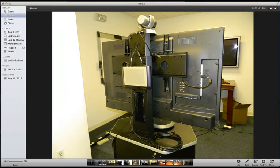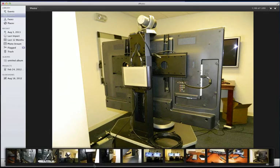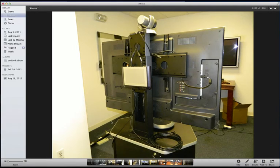Then obviously the Cat5 connection comes down from here, coils onto the rack, and sets your LifeSize phone out in front of you. And then you have a Cat5 connection that connects into the blue LAN connection on the codec. That simply runs down here and goes to the floor, connects to wherever your box may be, and you're left with just a power connection that connects down into the middle of the rack. So that's really it. It really is a very simple system to set up.